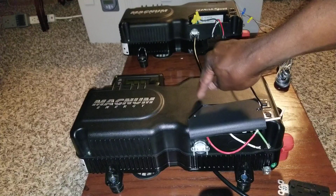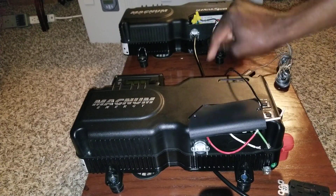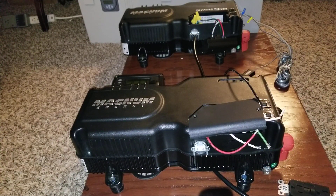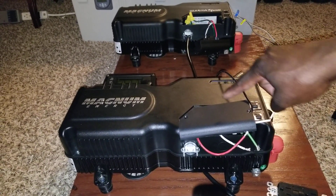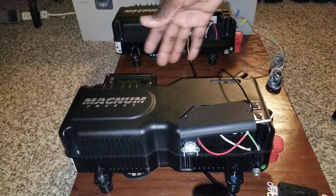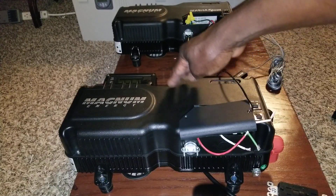These inverters need to be kept in good condition. If I had a spare plate, I could remove this GFCI and connect directly to my breaker box. I'd use a two-breaker setup because these inverters are in phase - not out of phase. So you cannot draw 120V and 120V from each simultaneously; you have to run loads independently.